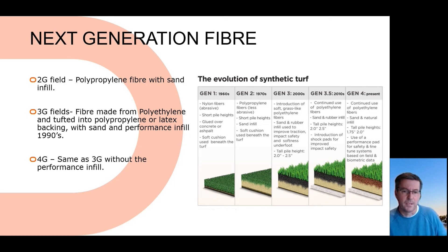There were a couple of unique things that FieldTurf patented that pushed performance to another level, one of which was in the backing. Most products are made up of a two-layered backing: the fibre is stitched through an open weave — a bit like the black porous cloth people use in gardens to keep weeds down, which lets water through. That's what the primary backing looks like. Then there's a second backing that goes across to effectively glue or fix the fibres into place — otherwise you'd just be pulling them out. In some cases that second backing is a latex backing.